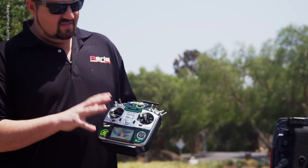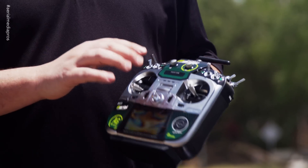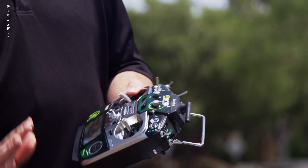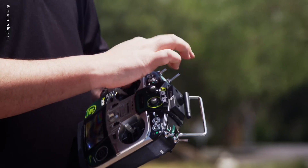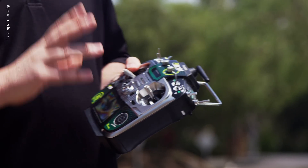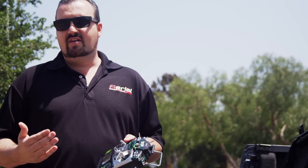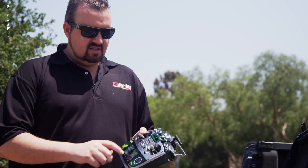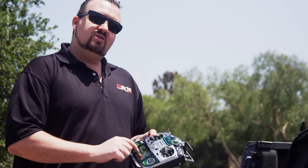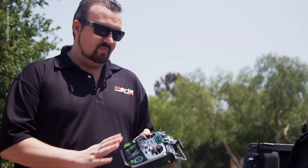This is one of my favorites — it's the Futaba 14SG. We do a custom wrap for you guys and we label all the switches so you know what does what. If it's not labeled and all it has is letters, that means that switch isn't activated. It's a good rule of thumb to put all your switches forward and away before you turn the radio on to make sure everything's in the proper position. Two main features of the 14SG: one, it's going to give you longer range communicating to the copter. The other thing I really like is it gives us the voltage display right here on the radio screen, so you'll always know the voltage of your copter. When this gets down to 11.1 volts, that's when you need to be back home and landing — it's an invaluable feature.